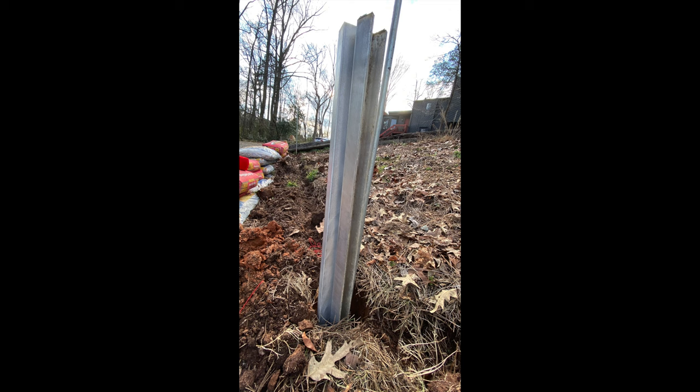One other reason I'm using a hand hole digger is because I don't want to use a power tool in case there are utilities underground. An auger will rip right through whatever's under there. We did get the local utilities to come and mark things, but I can't remember if we did that later — I was thinking, we should probably have these marked. You'll see in a little while that yeah, we should have gotten it marked earlier.